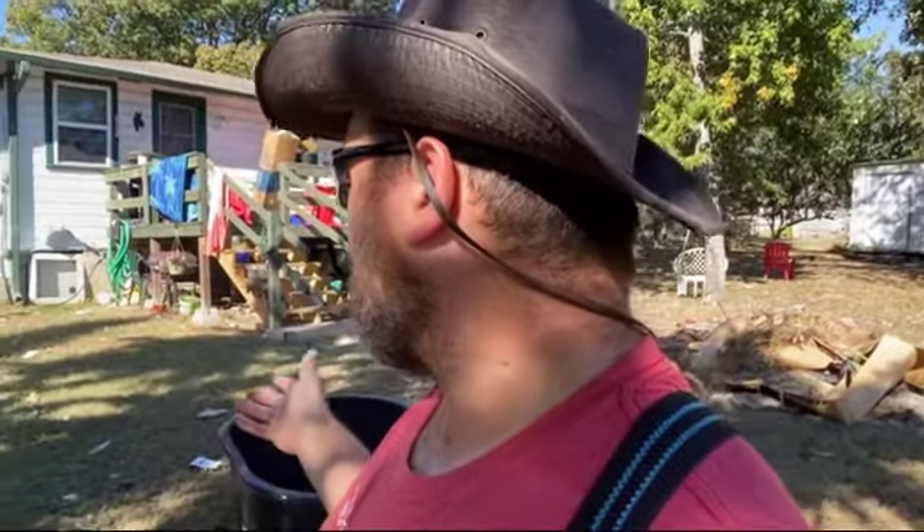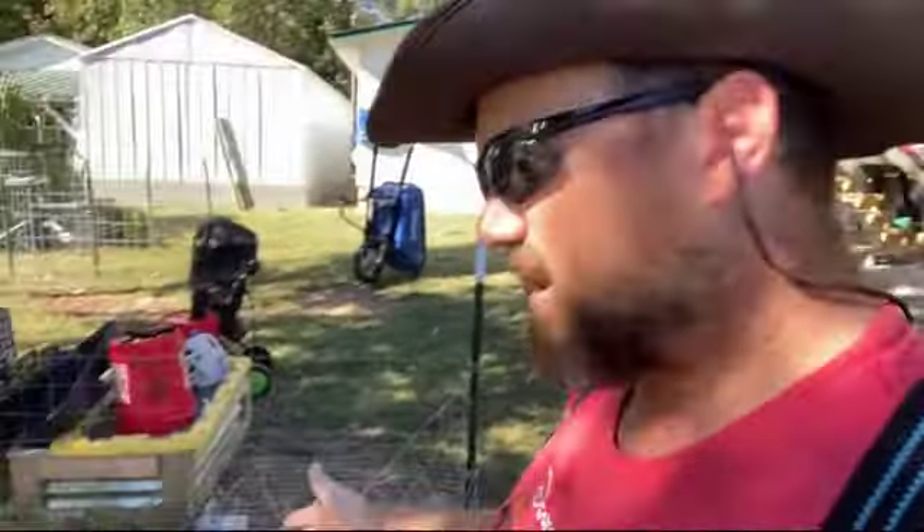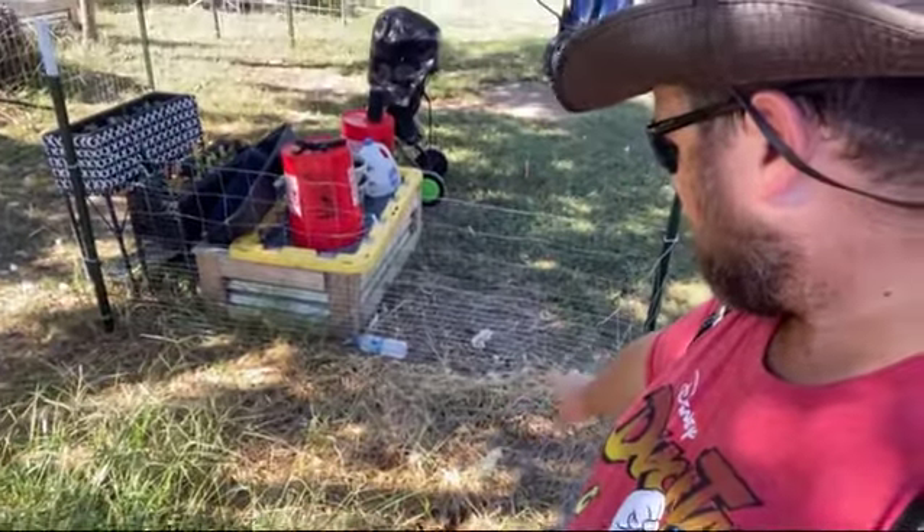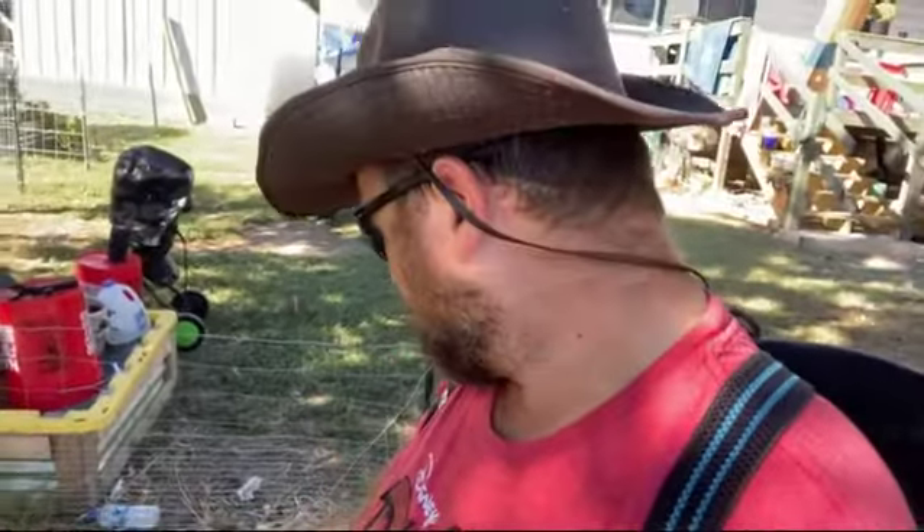All that gray water drainage from your dishwasher, washing machine, sink and everything comes down here so it doesn't fill up and go through your sump system or sewer system. That was easy enough to identify. But also in this area back here there's another larger, either two or three inch pipe that is also discharging in this area, but it doesn't seem to be hooked up to the gray water. We thought maybe it was some sort of overflow for the sump.